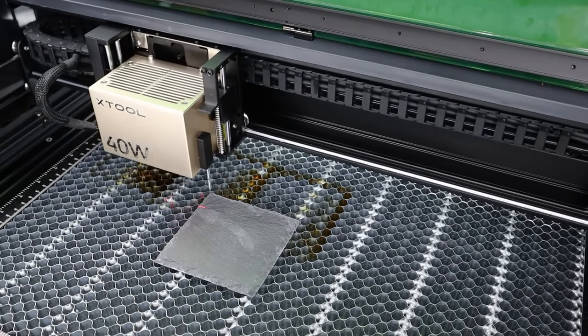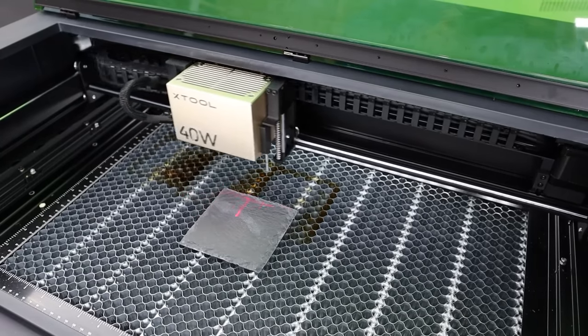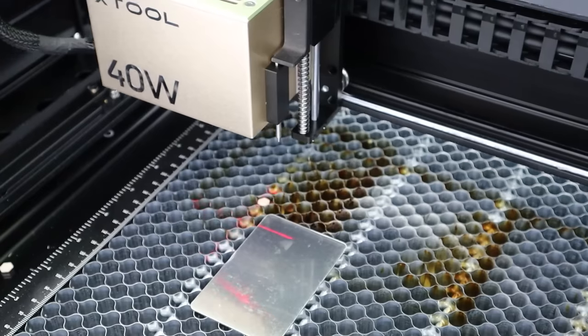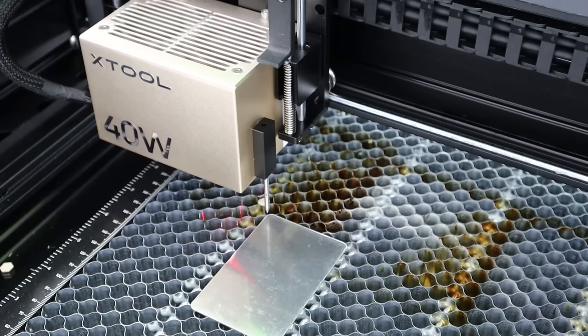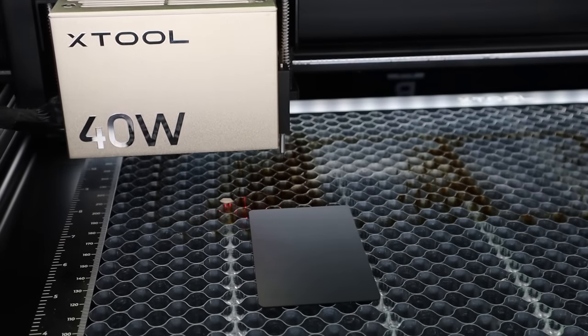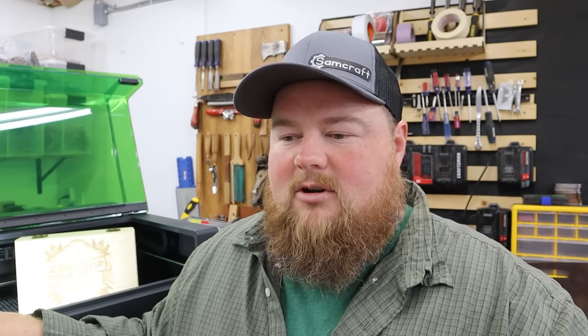The whole process of probing the material to find your height or focus is okay, but it's like an extra step. I understand the touch probe is a cool feature with great applications, but I feel like I'm kind of locked into using it, or I need to figure out the mystery number to punch into XTool Creative Space to account for it. What I mean is, when I probe and measure a business card — if the business card is a millimeter thick, I can't just punch in one millimeter; the distance the probe sensed is 44.9. It's probably in the documentation I didn't have, but it's one of those things where if you have to do it every time over and over from a production standpoint, it's going to get old.